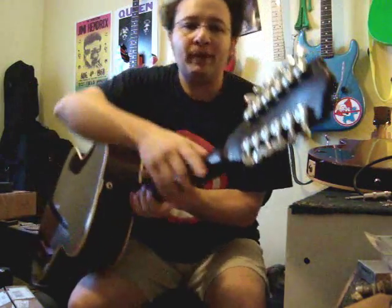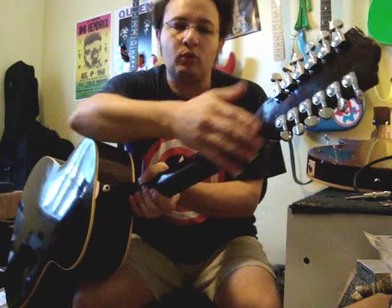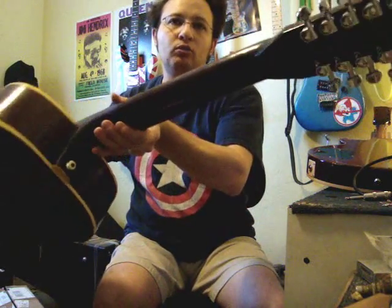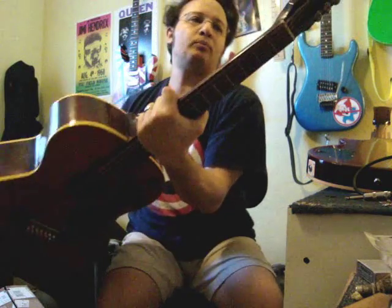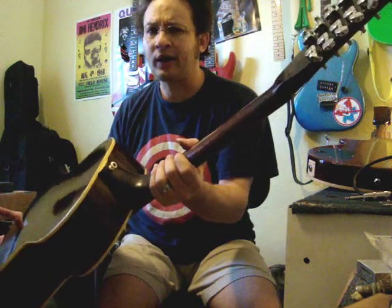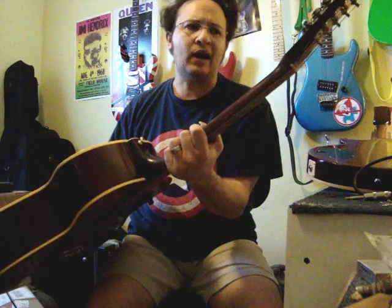What I had to do was — after basically repairing it — this section was completely separating off. You could actually fold the headstock open. So I had to re-glue all of this, but I also decided it's not enough to just re-glue it. I wanted to reshape the entire profile so that it would actually look like a decent voluted area. And I think I did a pretty decent job — it's nice and clean. I re-stained it; I sprayed it with some hickory stain to kind of blend all the light and dark areas from the dowels and whatnot.